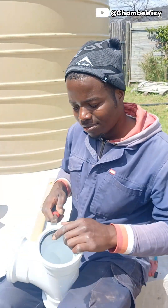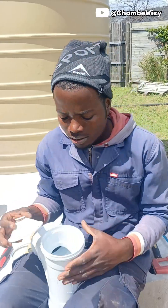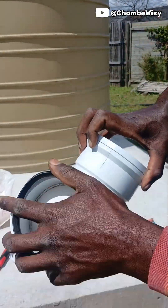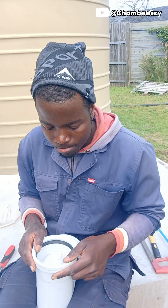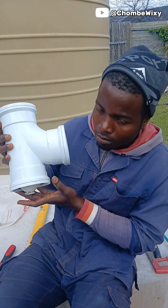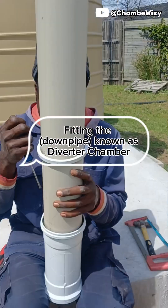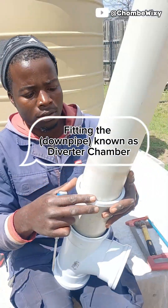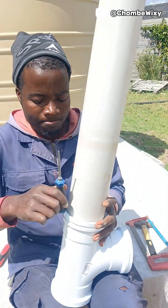I was not able to save the old transition fitting, so we had to buy a new one and it's a little bit different. The previous one needed PVC glue to join all the parts together, but this one has rubbers. So as you can see, I'm patiently fitting each part one by one — the rubber, the curve, everything, the pipe — to make sure it's all connected.